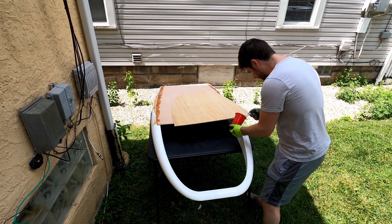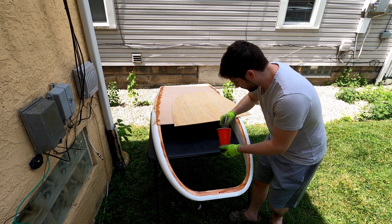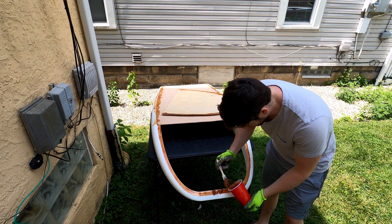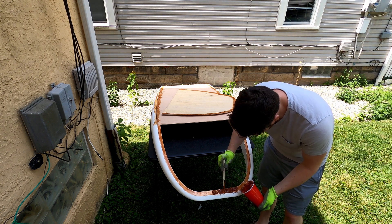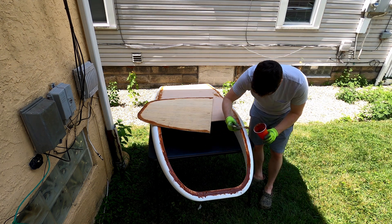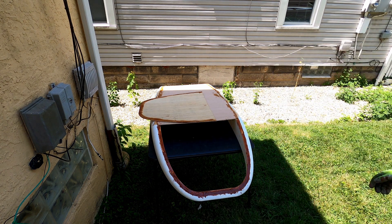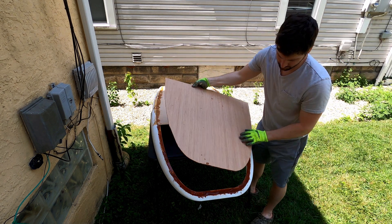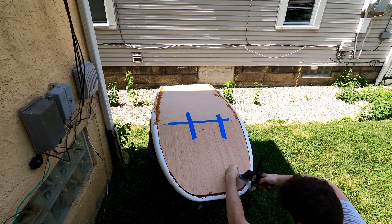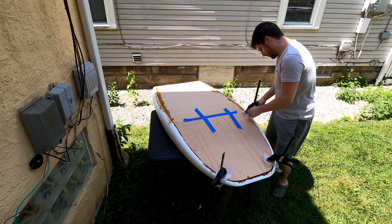For the front piece of the board, the groove that's supposed to hold that piece of wood wasn't quite perfect as far as being flush. So I ended up taking that already thick epoxy and adding silica to it, which made a really thick peanut butter-like paste. I'm applying it here, which really helped fill in some of the pockets that the wood created from not having that perfect seal. Clamping all that down made it squish out some of that thickened epoxy, making a nice waterproof seal around that edge.